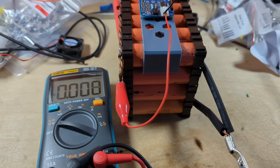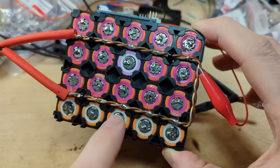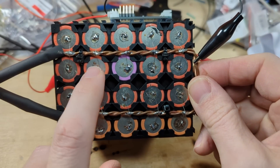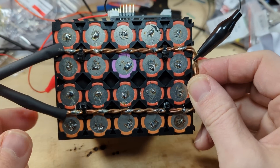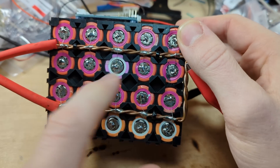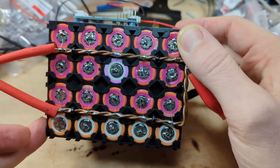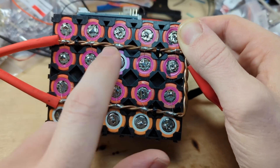This is definitely the one that is lower than the others. Looking at the fuses, they all look intact — can't see any major catastrophe that's happened here, no blown fuses, they're all looking good on the positive side and the negative side too. I've double-fused these packs. If I had a thermal imaging camera I might be able to find the cell that's acting as a resistive load, drawing energy out of the pack rather than supporting it.